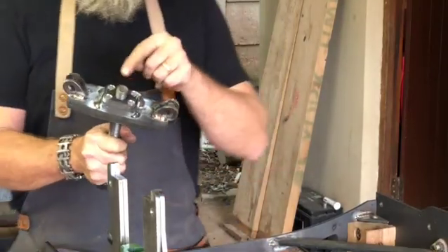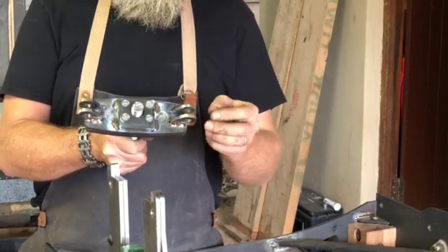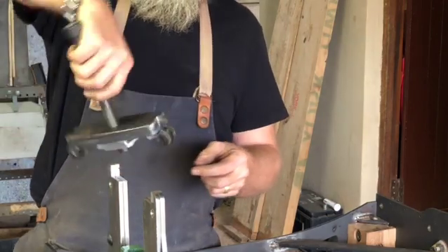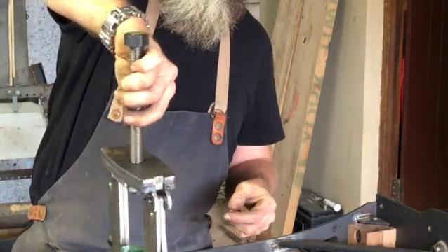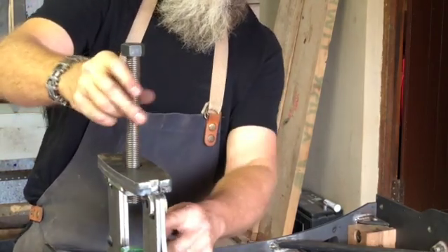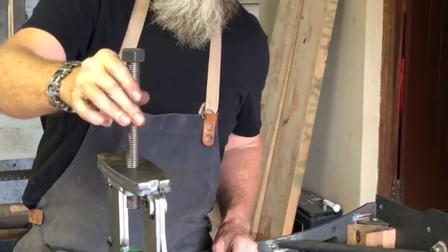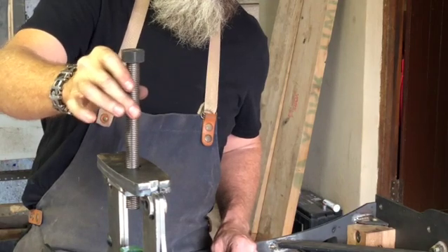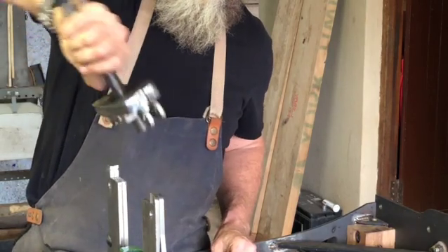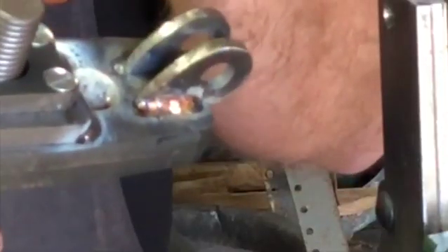You've just seen how I made this part. The previous press that I built had the nut welded in, but if it is a little bit misaligned, then when you screw this thread down and it comes to the bottom it doesn't match up with the bearing. So I decided not to weld the nut in and rather make it floating. That's why I went through the trouble of creating that extra part with the holes and tapped it.